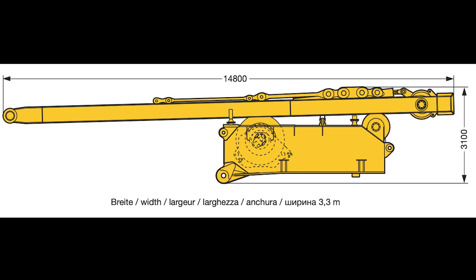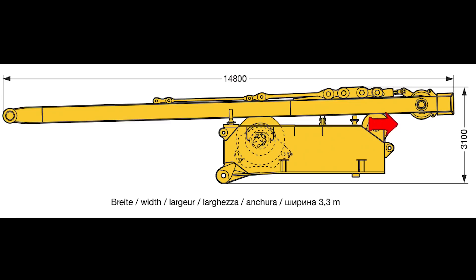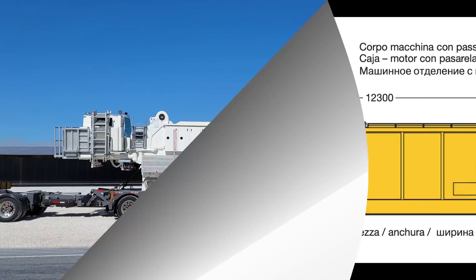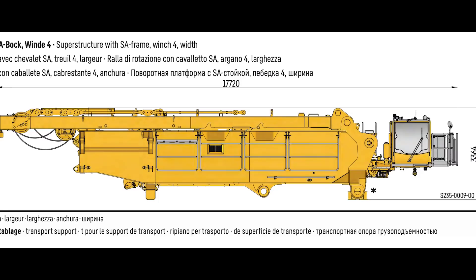Now we arrive at the upper section of the chassis, also known as the superstructure. Frankencrane's superstructure is divided into two main pieces: a rotating platform with a removable frame and winch number 4 — I will talk about the winches more in depth in the next video — measuring 14.8 meters in length, 3.1 meters in height, 3.3 meters in width and 44 tons in weight. It also features a machine room with walkway and cabin measuring 12.3 meters in length, 2.5 meters wide, 2.8 meters high and 17.6 tons heavy. By contrast, the new LR 11000 features a one-piece superstructure — the rotating platform and the machine room with walkway and cabin are just one piece ready to be mounted, making the mounting and transporting logistics easier and cheaper.